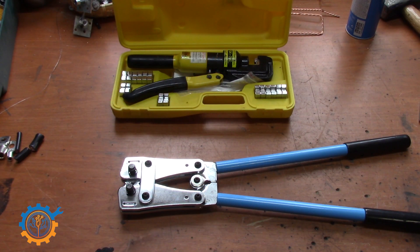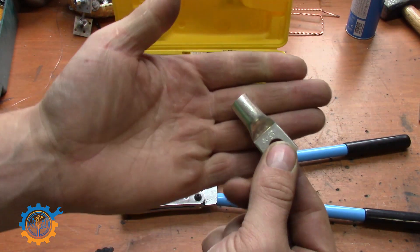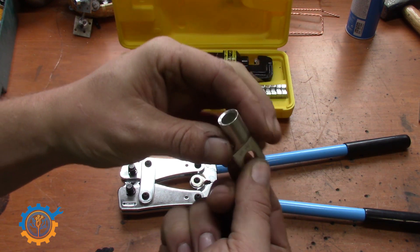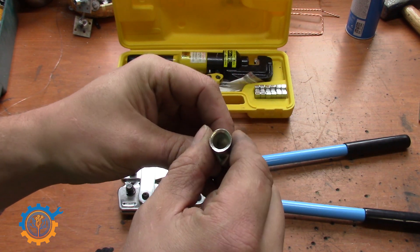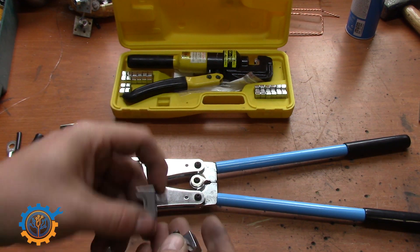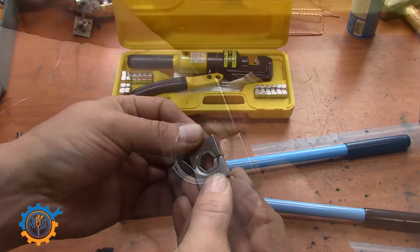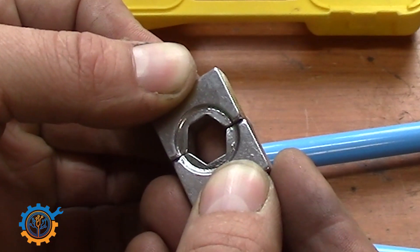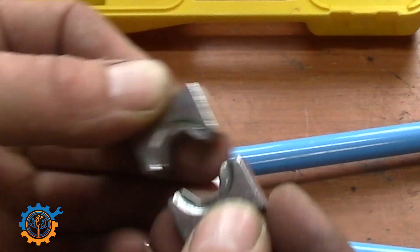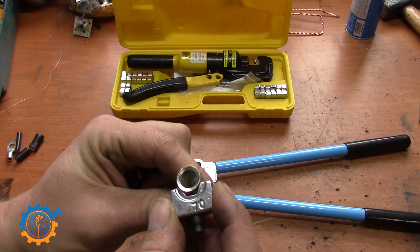It's now time to take a look at the proper tools — proper tools in terms of actually crimping in a six-edge way. The reason why you use proper tools is because when you are crimping the lugs, we want the lug to be crimped in every direction together to make the area as small as possible so that the wire inside cannot come loose and you bond them together. If we take the tools here, you will see that they are formed with six edges, and that means when they press together they will press tighter and tighter.